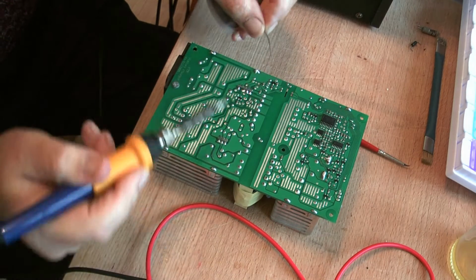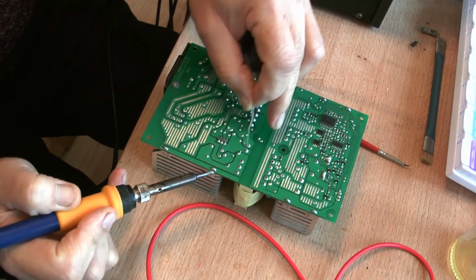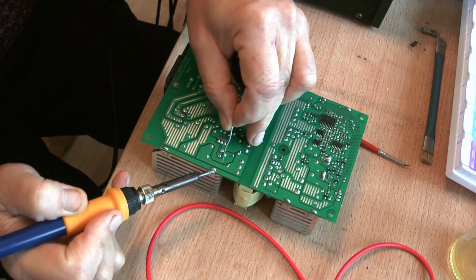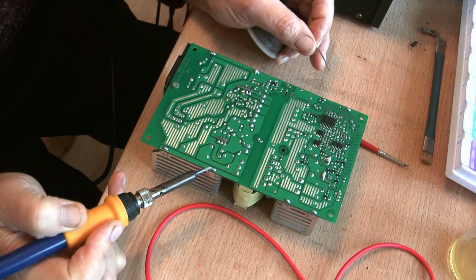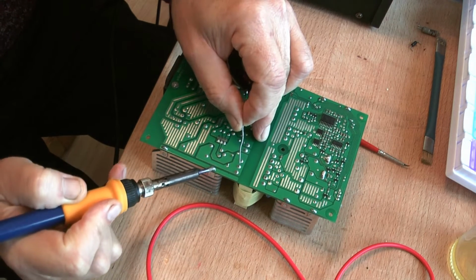It's not going to drop the temperature right down to the same temperature as this melts out, because the eutectic won't be a perfect one for that application, but it'll drop it below. Roughly, with ours here, it's 220, and we're going to drop the temperature down a little bit. Anything helps. Now right, here we go again.